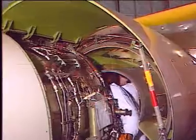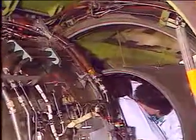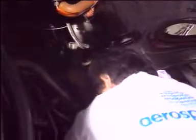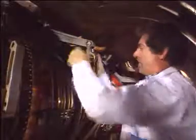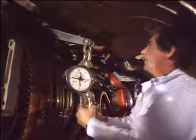On the forward engine mount, each bolt is loosened and retorqued to the maximum force an operator using a standard wrench can apply. The center hinge clamp of the forward bootstrap is then fixed on the pyramid, where hinge arms will be installed. The rear beam of the bootstrap equipment is fixed on the pylon lower part. Then the dynamometers and chain pulley blocks are installed.